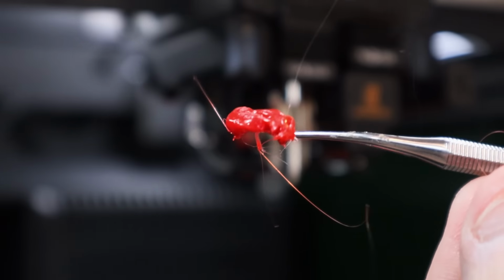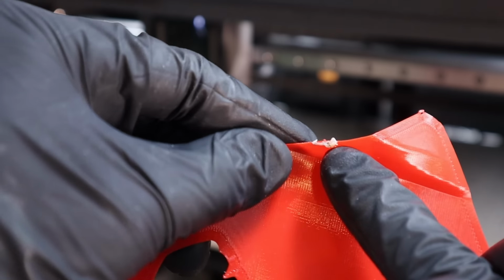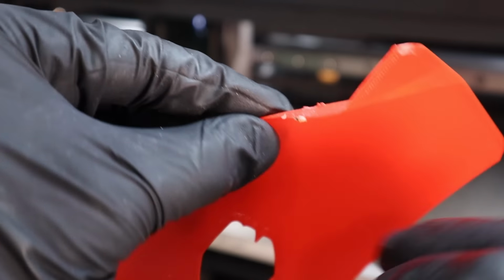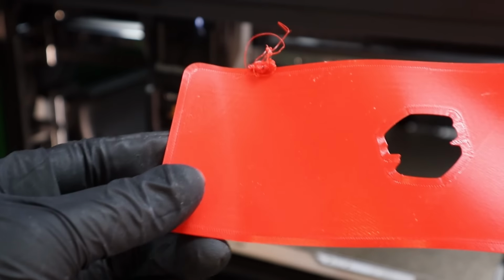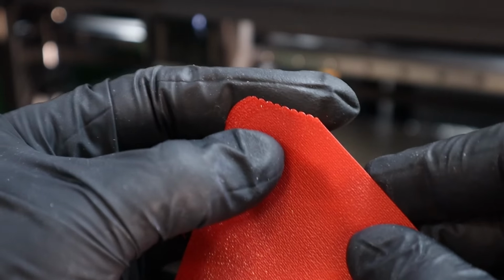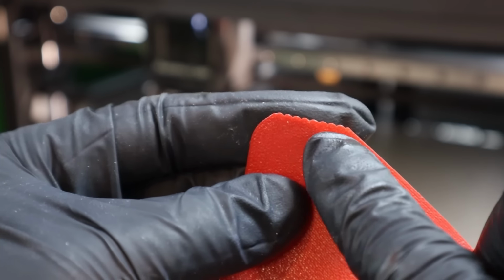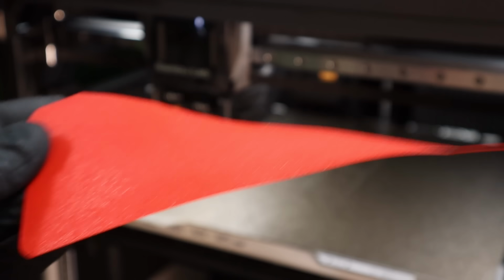How do I know this? Well, I've never actually had a print come off the build plate during a print when I used glue stick, and it wasn't a problem before this, and it hasn't been a problem since. So to test that, I didn't clean the build plate, I just applied glue stick, and I had the exact same issue. And when I stopped the print and re-cleaned it properly, the problem was gone. The source was a massive lapse in judgment, human error, also known as stupidity.